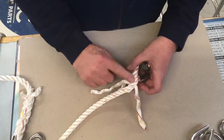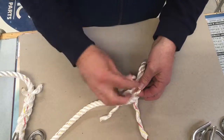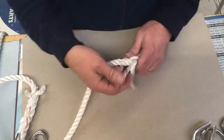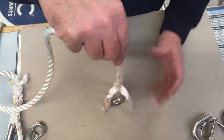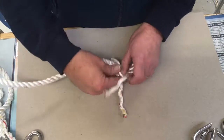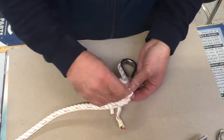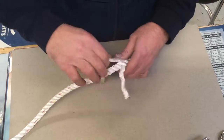If you get to that part, the rest of it is almost easy. You see this one will be exposed on that back side. You need to take that first one once again and go up underneath, pull through, and here's where you wanna snug everything up nice and tight. Pull everything good, square it up on the thimble if you're using a thimble. Tighten it up good, and if you got it right, you could hold it upside down right now, and you can see how they just fall in like three pieces there, in almost a triangle form. From that point, you can grab any one of them and just keep rotating — run the line underneath itself. This is what is considered the correct term: the back splice.